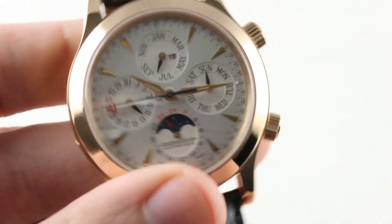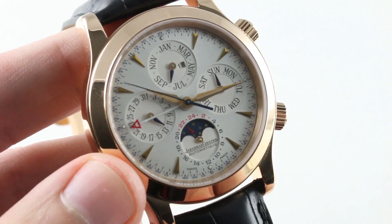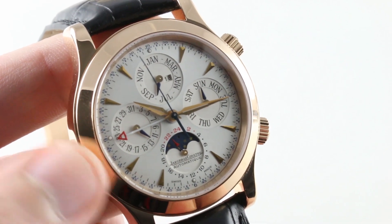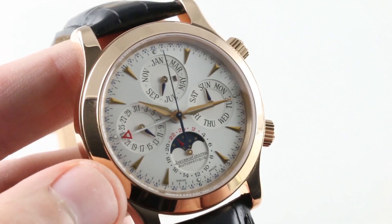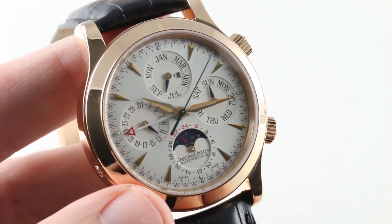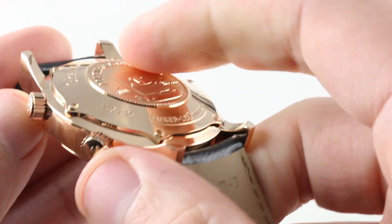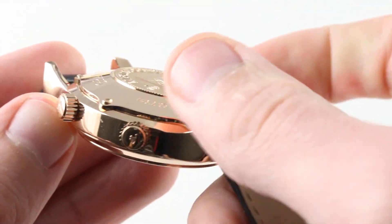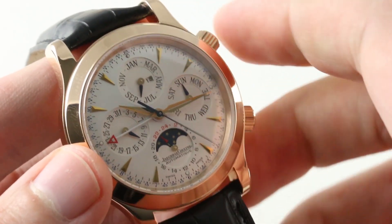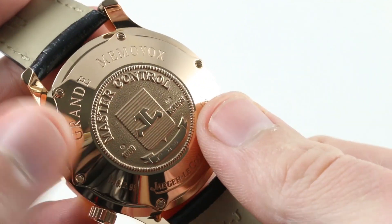And it will go and go and go. At full wind, you'll get about 30 seconds of discharge out of the alarm, especially when it's placed on a counter or a nightstand. And it has a tendency to resonate immensely, so if this thing is on wood or glass, rest assured it will wake you up in the wee hours. And that's the acid test of any alarm watch — can it serve as an alarm clock? Can it wake you up for a 3AM red eye? And this one can. That's because there's a wonderful bronze gong inside the case that hangs separate from the case. Previous generations of alarm watches simply struck the case or the case back. This one has a separate ringing resonance due to that bronze gong, and it's freestanding. One of the reasons why there is a solid case back on the watch is the space between the gong and the winding rotor — there's really not much to see. I'll take the solid gold case back, thanks.